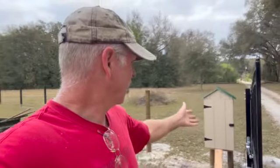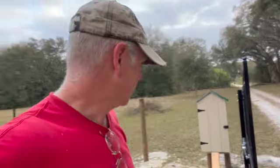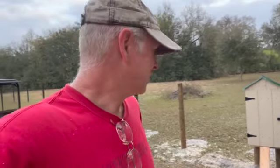And the other is it's close enough now to everything so that it can take the power and everything as it comes in. Here's the problem with my design. And you're looking at this and you're saying to yourself one word. You're all saying it. And I hear you. Concrete. Yes, that would have been a fantastic idea. I got so excited to do this. I put the posts in it. It's not going to fall over because the holes are actually just a little bit wider than the posts themselves. But it may lean. And that means that I'm going to have to undo. Not today.